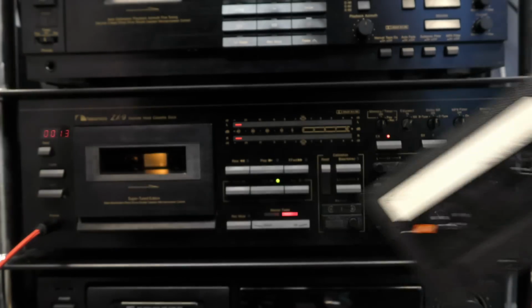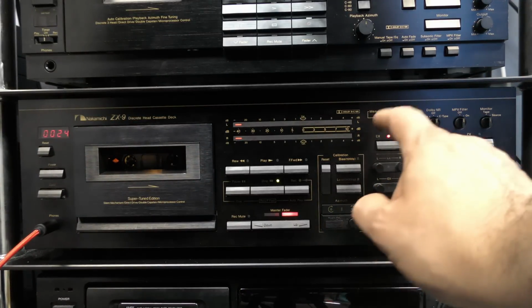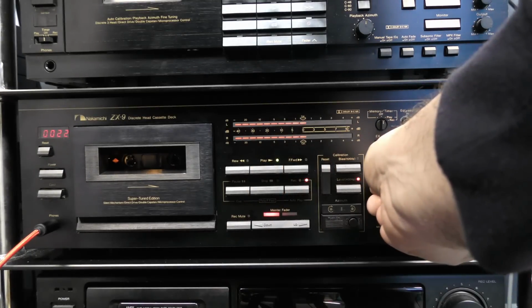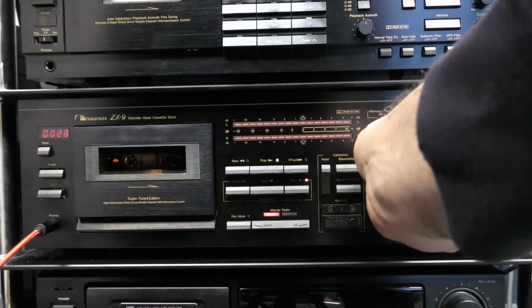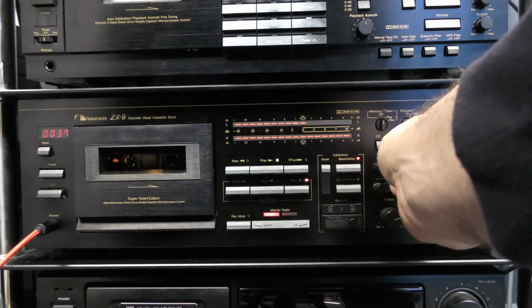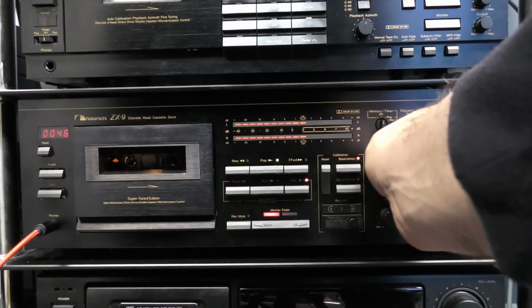All right, let's get it biased up. So tape EX120, yeah. Okay, level bias. Whoa, bias is a tad over there. Yeesh. I think this is from trying to think what cassette I was trying to do in this last. Was it that? It's probably the EMI, was it? I need to crank that all the way back. There we go. That's more acceptable.